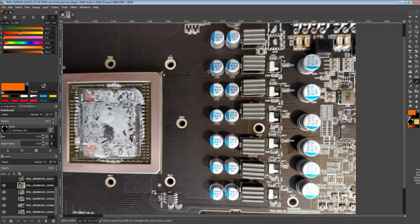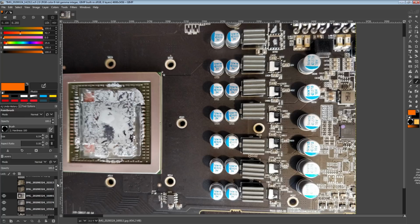So that would explain the results that we're seeing, and it's actually really interesting that this is so much worse on the overshoot, because that is one place where you'd actually expect the extra capacitance to help a lot. But I guess the GPU just transitions from full load to idle so sharply that the ESL of these is significantly hurting even that. So yeah, SMD aluminum polymers are pretty overpowered. If you want one good transient response, you just throw on a bunch of aluminum SMD polymers and everything's good. And if you want bad transient response, you go with through-hole caps.